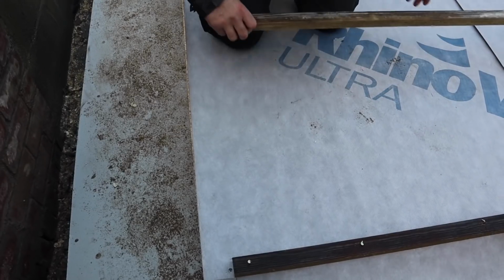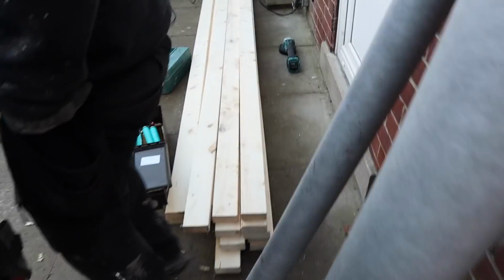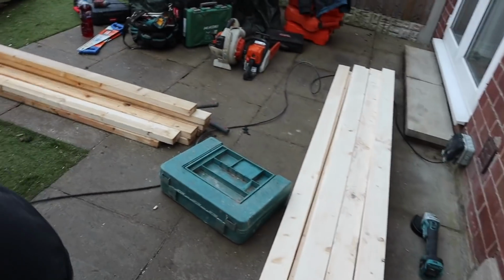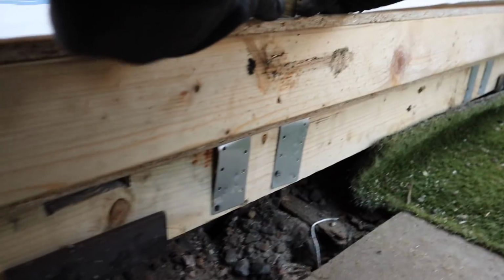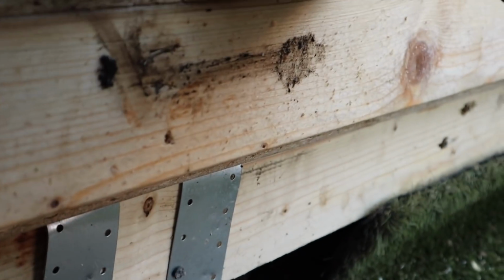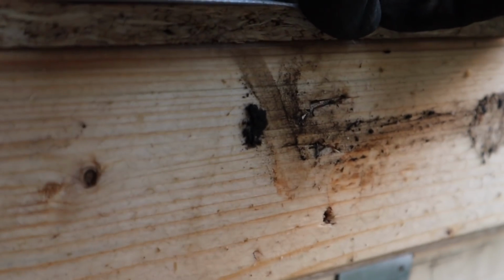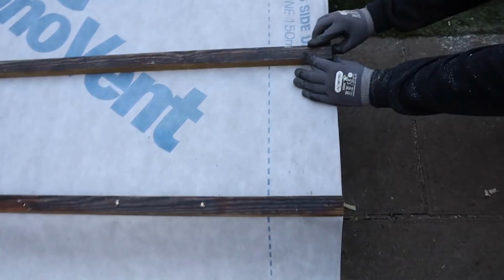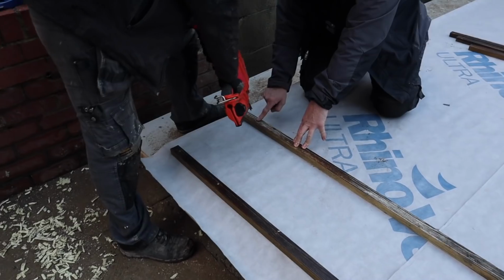Adam, get back up there. So what Adam's going to do is locate where the nails are. You see where the nails are, Adam? He's then going to put that central. He's put that central, it's flush at the top. What I'm going to do, exactly the same at the bottom, look for the nails, which I've found. I've got the timber central. Michael, don't nail past there because there's nothing there, so you can come at least 4 or 5 inches up.